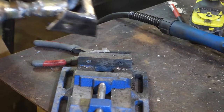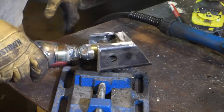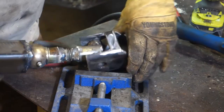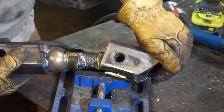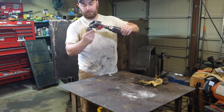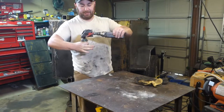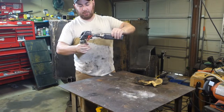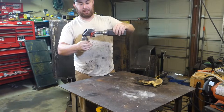Now we have our bung for filling this with grease. The next step is to weld the spacer collar on here — this is simply the other half of that piece from over there. We're just going to weld these two together. Next, I took one of our washers and cut it in half, then cut pieces off so it fits in here. That way when you're hooking the trailer up you can basically just set this on here and it's going to line up pretty close with the dowel pins — that'll make loading and unloading the trailer a little bit easier.